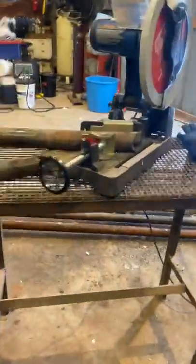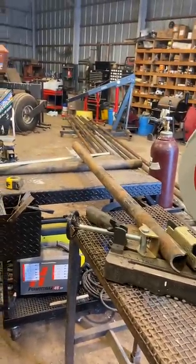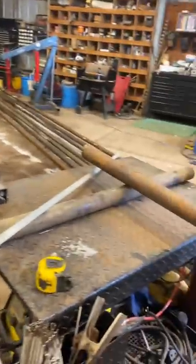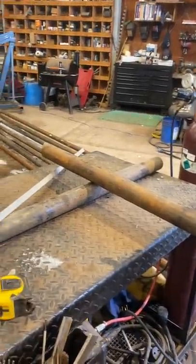So this is the last one I did. I use a chop saw and I feel like if you can get your measurements right and your angles, it seems to do a pretty good job. I usually start off with a five-foot stem of drill pipe because that's the same length I use for the legs on these freestanding panels.